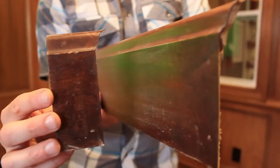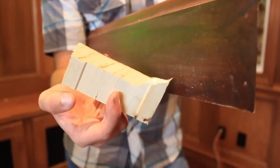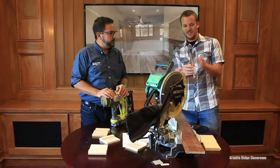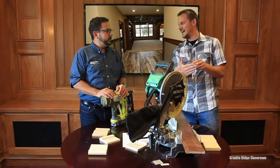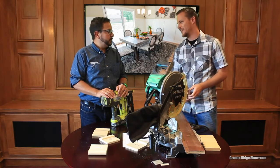And what's nice about that is we're dealing with wood most of the time when it comes to trim. So it expands and contracts. Well, with a cope joint, you run this against your eyesight and you actually won't see that expanding and contracting. If you did two 45s, that's when you'll notice that they're pulling apart.